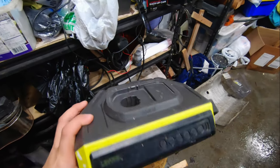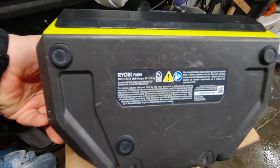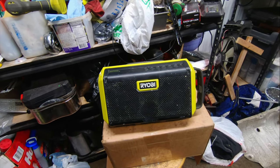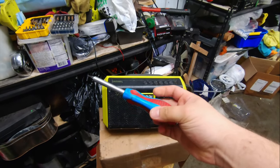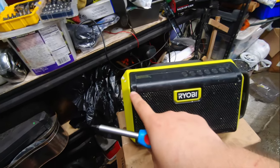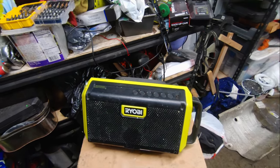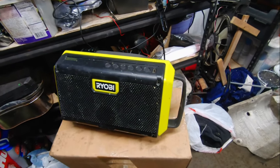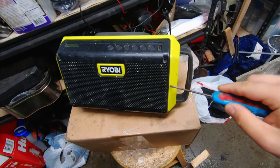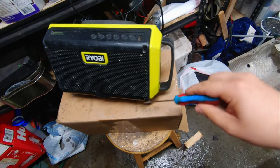The model number for this is the PAD 01 and it's actually pretty easy to do — you just need a soldering iron. The first step: you'll need a screwdriver with a pretty small bit and you'll unscrew these four screws. After you've unscrewed it, grab a screwdriver or you can use plastic pry tools if yours isn't scratched up like mine, and just jam it right in here.